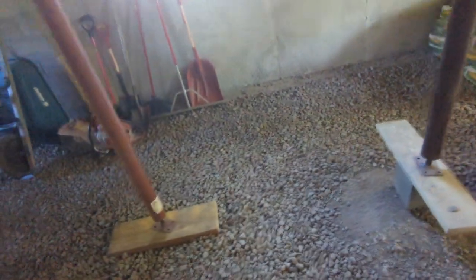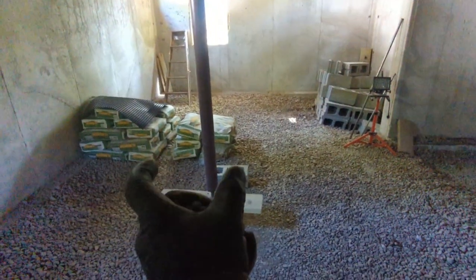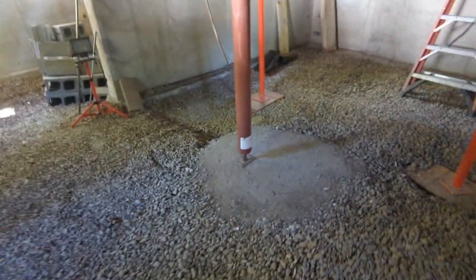And so we found one about 14 steps at about 7 and some inches. I forget the math right now. But if you're going to do 14 steps down at that height, they have to be at least 9 inches deep, and I'd like 10. Plus 10 makes for a round number. So we start looking at 14 steps at 10 inches deep is 140.